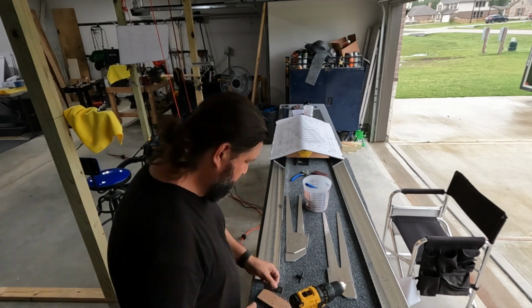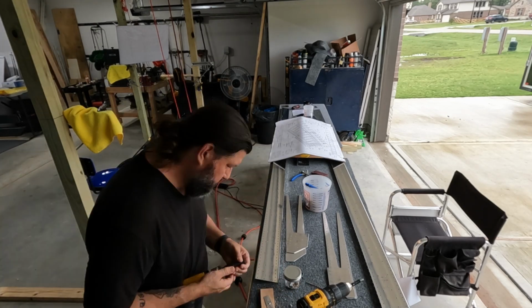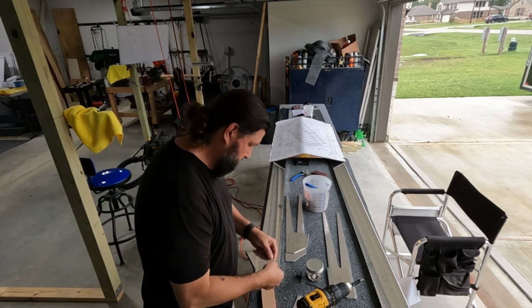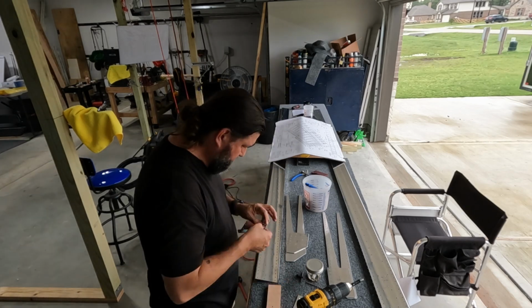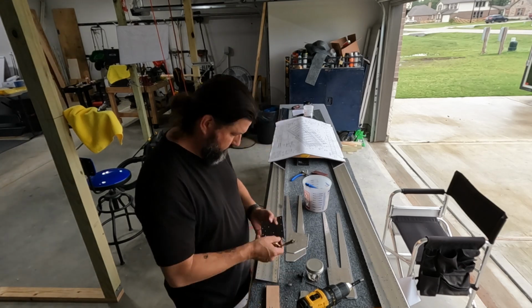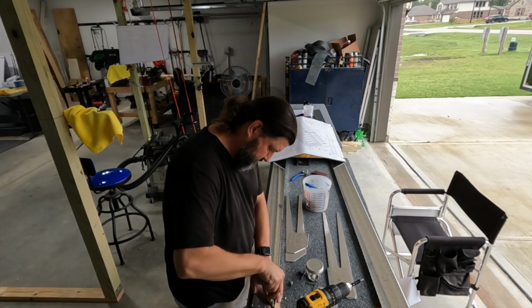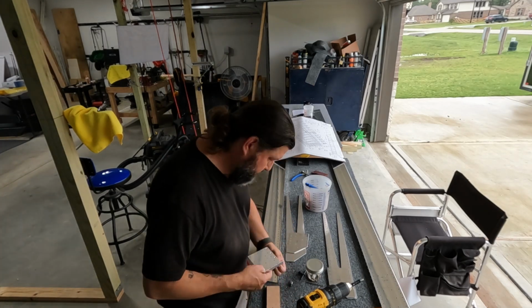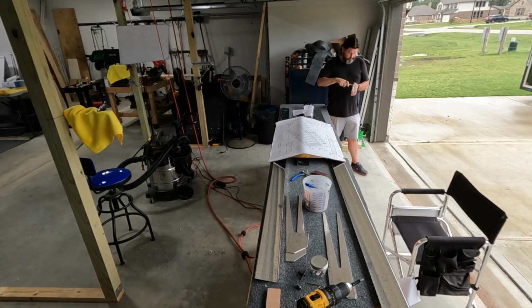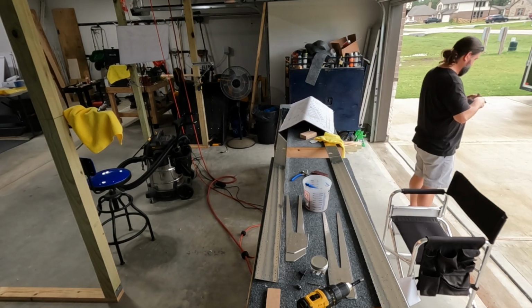The instructions tell you that once those reinforcement forks are in place, riveted in place, it is nearly impossible to dimple the holes on the spar flange, and you do yourself a favor by going ahead and final size drilling those holes along the flange and dimpling them now, because the next step in this prep process, which will happen in the next video, is getting all of those rear spar components riveted on.